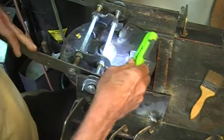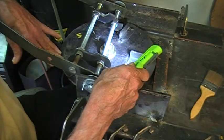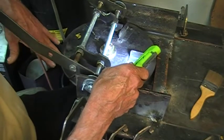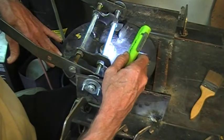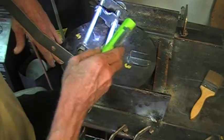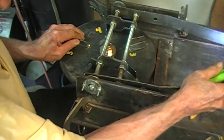Now over here at this point it's moving, but if it comes up, it's hitting — that's all the slack we have. Before we had three-eighths of an inch every time. This point right here happens 10 times every time this wheel goes around once. So three-eighths of an inch times 10 is a lot of wasted motion. Hopefully we've reduced that considerably. A little pressure on the wheel — bam — like so. No wasted motion, or rather very little.